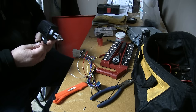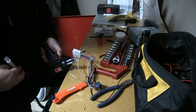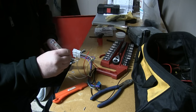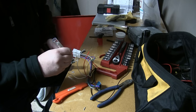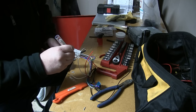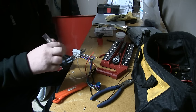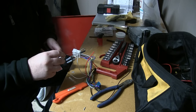So I've got some electrical solder here — it's a lead-free solder that I'm using. I'm going to put the solder gun underneath the wire and heat the wire up, preheat it. And when it's warm, I'm going to put the solder on the top. That just kind of allows the solder to flow into the wires, and that way it makes a real good solder connection. So I'm heating it up, and when that flows in, it'll kind of flow around that entire wire. And that flux helps that happen — helps it flow into the wires a little bit better.